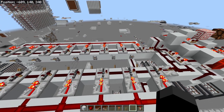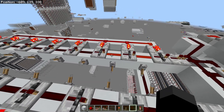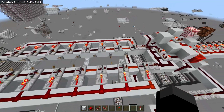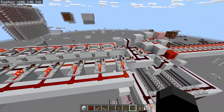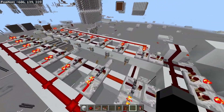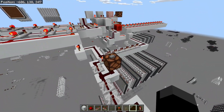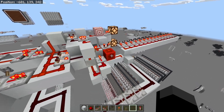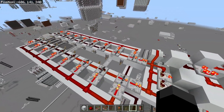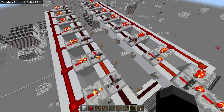So first let's add the numbers three and five. We put three into this input shift register and five into the other one. The way I've designed this is that when you clock it, it will load the number into the shift registers and also start the addition. So we clock it once — the first result of our addition is zero, that's the first bit — and we also need to clear the inputs so we don't corrupt any data.